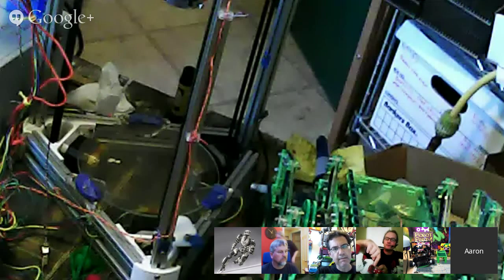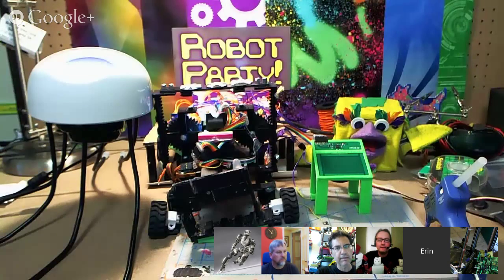They're very similar to this guy's AX12s, but they're just a smaller form factor, a little cheaper. Like I said, they're plastic gears. This guy has metal gears in his servos, so they're almost $50, and it's hard to see, but they're a smaller form factor, and they're really nice servos for the price. Like I said, around $22, but nice holding torque, especially since you need that for humanoid applications.